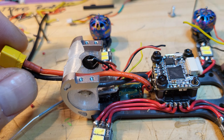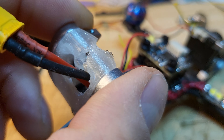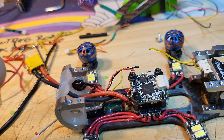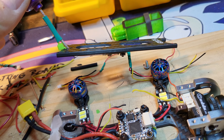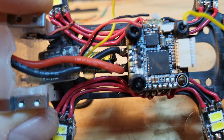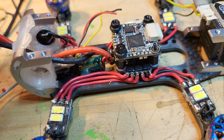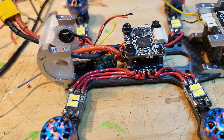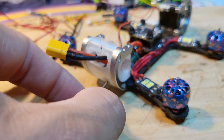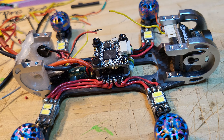We are going to do a top mount battery. I already had this length for the power lead from the other setup, so we're leaving it. Made a hole in the back with a little room to wiggle side to side, and that's going to go up. We're probably going to run the Race Day Quads 2S 650s, which fit perfect on there. The receiver for now is just double-sided velcro underneath the power wires — a little hot glue will get in there, but I want to be able to access it until we get it bound and good to go. I poked a little hole in the back, and I'll do some heat shrink to protect it.